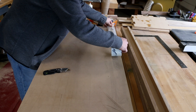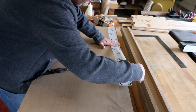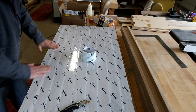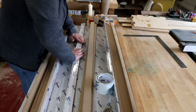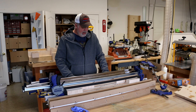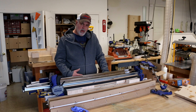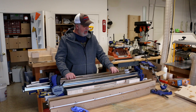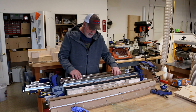I need to glue these segments end to end, which is not the strongest of joints. I'll need to clamp both end to end with some moderate pressure as well as laterally to keep each segment as straight as possible. So I made up this clamping jig — it is large enough and has enough dividers in the middle that I can glue up four segments at a time. I'm taking my time test-fitting and test-clamping without glue for each of the segments.